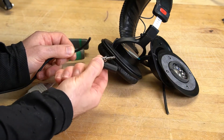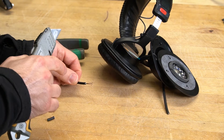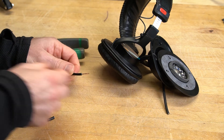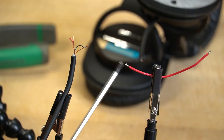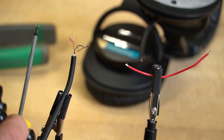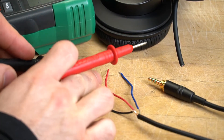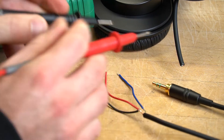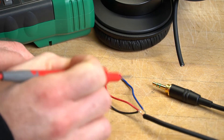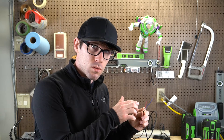I have a little piece here that I'm going to use to remake this into a functioning cable. The best way I found to strip cable like this is to roll a sharp utility knife on it in a circle carefully so you don't cut the wires — you can actually leave a little bit of the jacket on because eventually it gets so weak you can twist and pull it off. These wires are insulated by a coating of enamel that you can burn away with solder and heat. Lucky for me, no nail polish was required — just heat and solder. I put my multimeter in continuity mode to test the connection. The green wire is connected to the tip, the red wire to the ring, and the black wire to the sleeve.